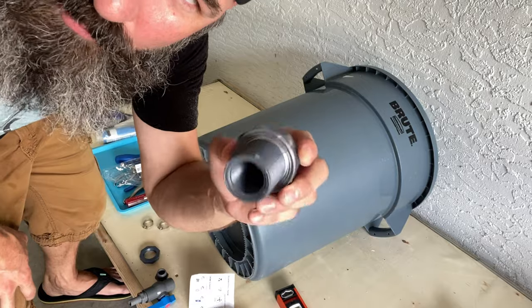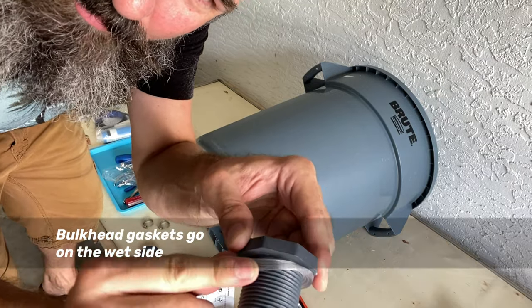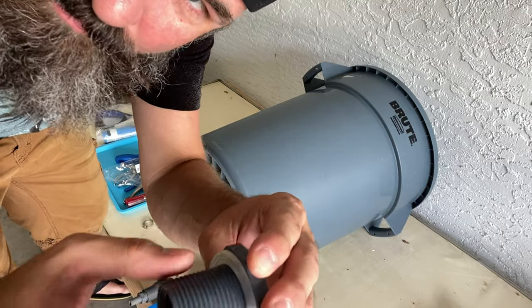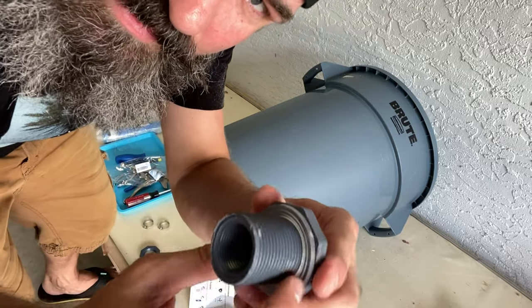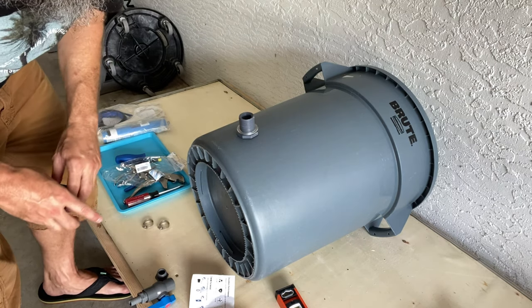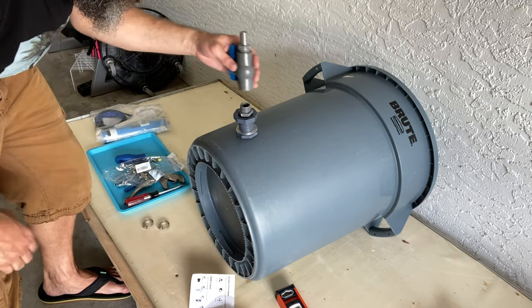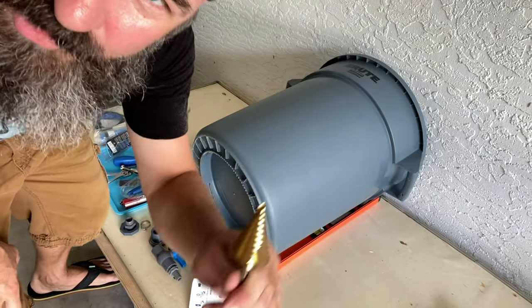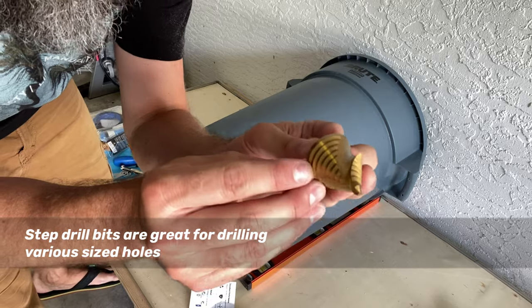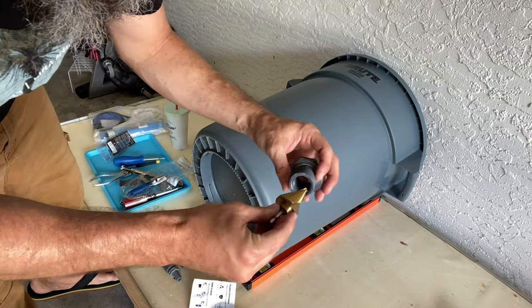Remember when working with bulkheads — the gasket, this little seal part, always goes on the inside where the water is. It doesn't serve any purpose on the outside, the dry side. It's always inside, wet side. So I'm going to drill a hole large enough for this. The gasket goes on the inside, the nut goes on the outside along with this. These step drill bits are great for drilling holes of various sizes — each mark represents a different size — and we're going to drill a size to fit this bulkhead.